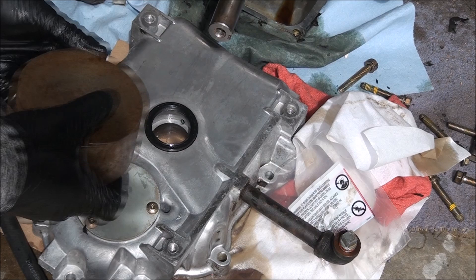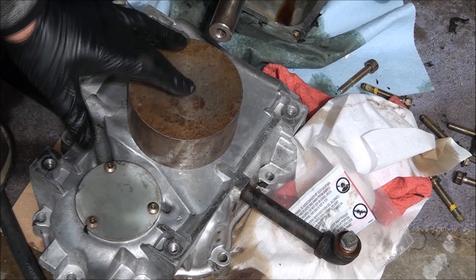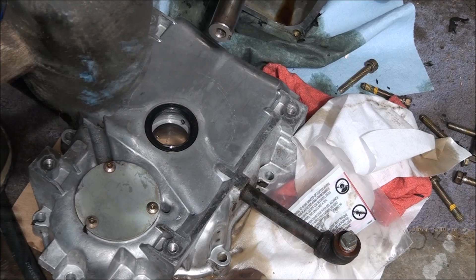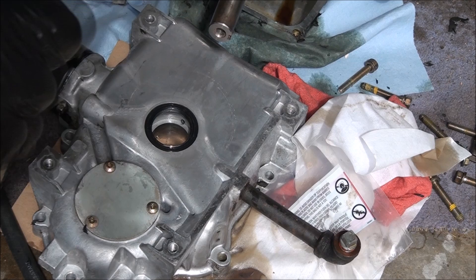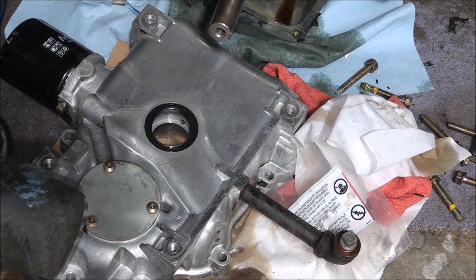Hear how it started to change tone — I know it's pressed in now. See, it's perfectly flat, but we need to go a little bit deeper. I looked at the manual and it says verbatim 'slightly below the mounting surface,' so we need to get this oil seal down a little bit more. I think how I'm going to try to do that first is by using the old seal, putting it on upside down.